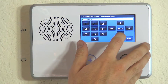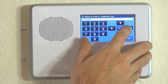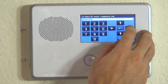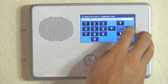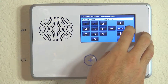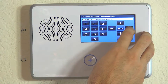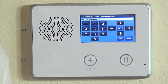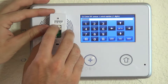You can choose motion or contact, and in our case it's a contact. So we hit the down arrow, and we're on equipment code. This is where we tell the GO Control Panel the specific device we're using. So we scroll over until we see 2GIG D-Bell — all the way at the end there, 2GIG doorbell. Go ahead and hit the down arrow to lock that in. And we can type in our serial number, which is our transmission ID number.